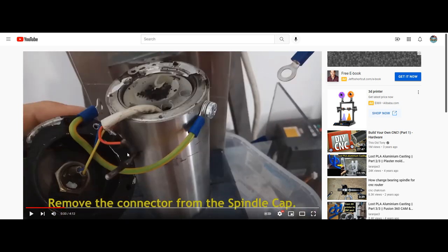And then as we look over here, he's right, this pin has totally been fried, and you can rest assured that actual dead short was probably going back into the motor itself. That's why I say, to actually say that this spindle is fine and there's no damage, it would really have to be tested well for that.